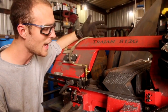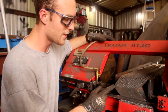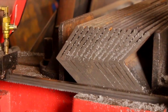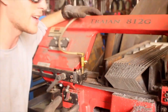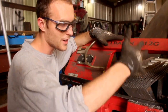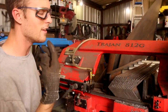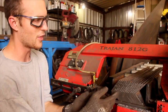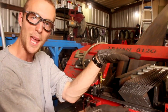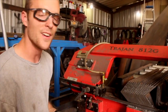A couple other things to keep in mind: it looks like we could fit about 20 pieces of this in here before we run out of room. The other reason why I like to cut stuff horizontally — squeezing the pieces together in the vise instead of vertically where they'd be stacked — is that it's just a lot less likely to move. And the main thing with that comes from the fact that most band saws, this one included — this is an 8 by 12 saw, 12-inch capacity here, 8-inch capacity here — so we can get 50% more angle iron if we lay it across like this.